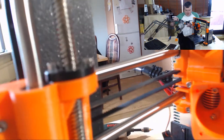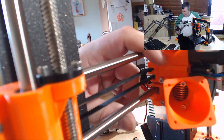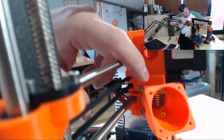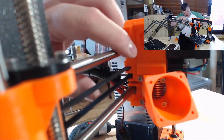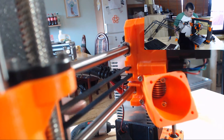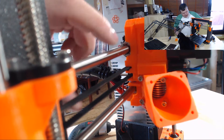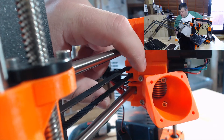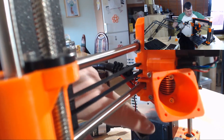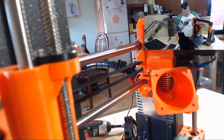Now the piece is mounted and it was quite easy. You just have to make sure the part is pressed against the extruder assembly before you tighten, because the screws were threading into this part as well. So at first it had a small gap, but I just took the screws out and put them back in and made sure this was quite fit to the extruder assembly part. There is a lot of free wire on the fan so I can put those together.